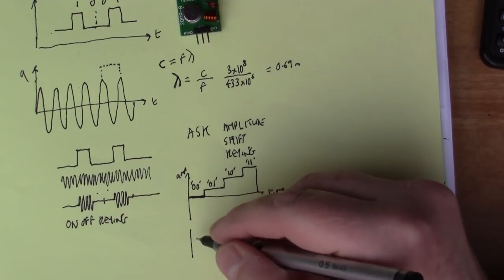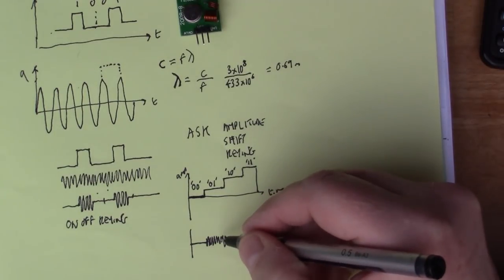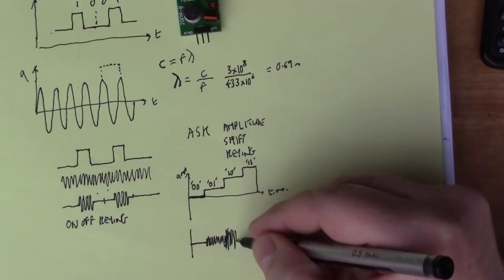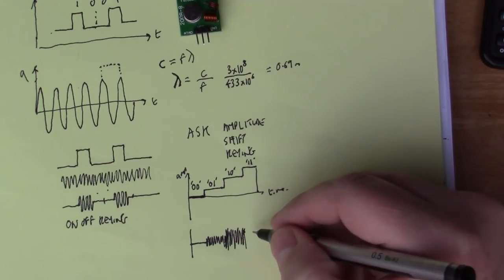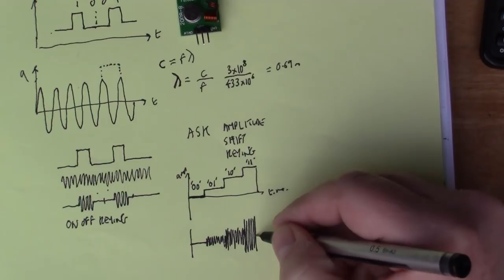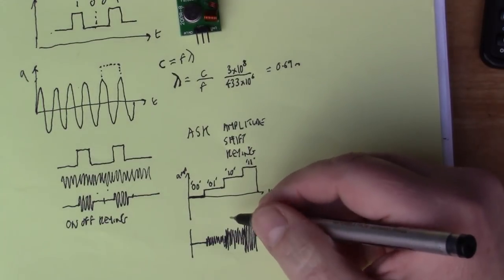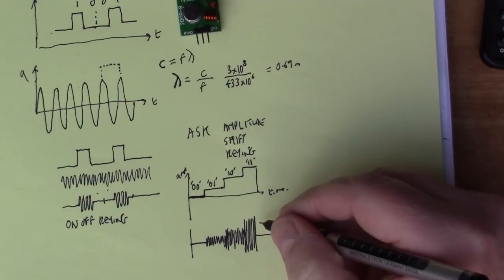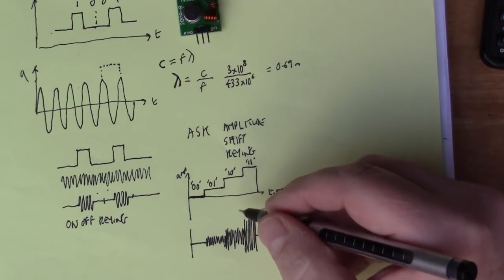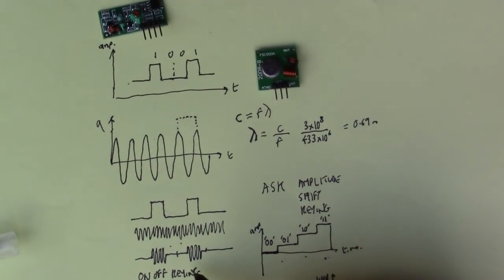So if we modulated that signal, we would get a burst of 433 like this that represents 0 1, and for 1 0 we'd have a slightly louder 433 megahertz burst, and then finally for 1 1 we'd have the maximum, like that. So you've got four levels that you can represent: nothing and three other levels of amplitude. And when you receive this in a general ASK system, you have to measure the amplitude, because the amplitude tells you which category you've got. But today we're just going to use this simple on-off keying system,